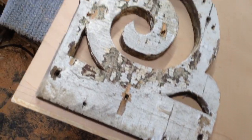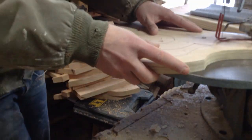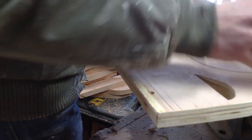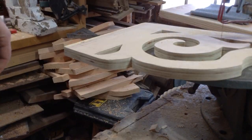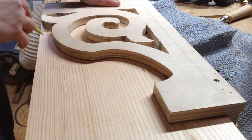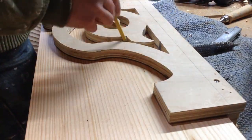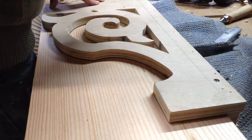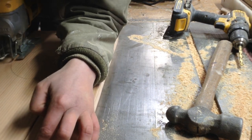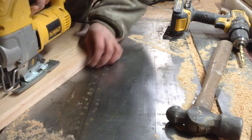You can see I have it lined up and the pattern looks pretty good - it matches quite well, I was pretty happy with it. To make this one, I'm going to go through a little bit faster because most of the process is the same, minus cutting out that inner decorative panel. I made a jig again, and to cut out that inner panel, you can see I have a couple of drilled holes so I could feed the scroll saw blade into. I'm cutting this out with the scroll saw - I only did the decoration on one side; I was nervous doing it top and bottom that it wouldn't line up perfectly.